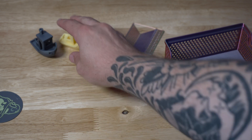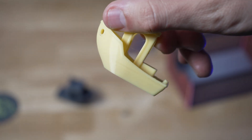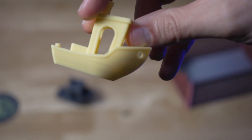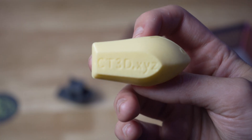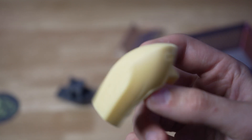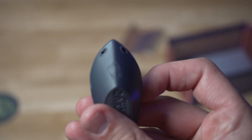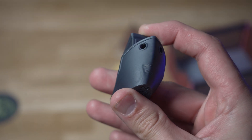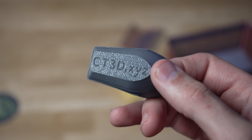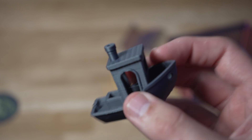The first thing I did was print two Benchys — one in yellow and one in high-speed gray. The yellow Benchy looks really good: no artifacts or defects, just a little bit of stringing which can be cleaned up easily. First layer adhesion was great. The high-speed PLA one had a little bit of artifacting — I'm guessing from the pressure advance — but I tuned it in the slicer and got it resolved in the other print. Overall layer adhesion looks great and I'm really satisfied with how these filaments turned out.